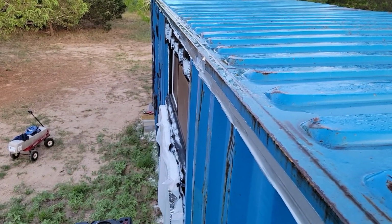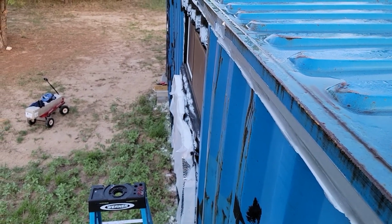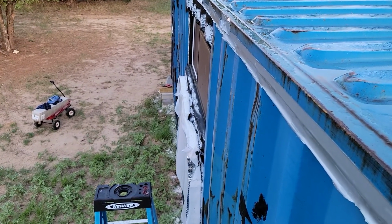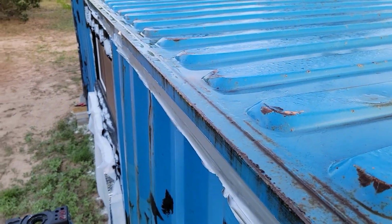So I looked at rammed earth, I looked at aircrete, I looked at perlite, and I looked at Hardie Plank, and now I'm at earthbags. Of all those things, earthbags is the most flexible for a single man to manage in stages without cold seams. And reading about the Nepali people who've been building their civic buildings and homes out of earthbags, they built 55 large structures, and even with the earthquakes, they haven't lost a single structure.